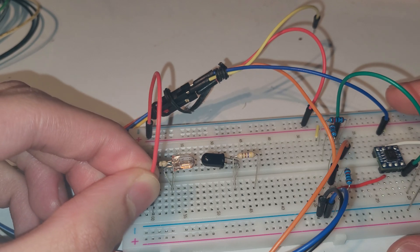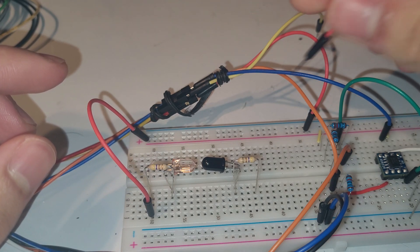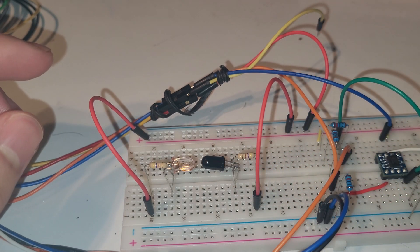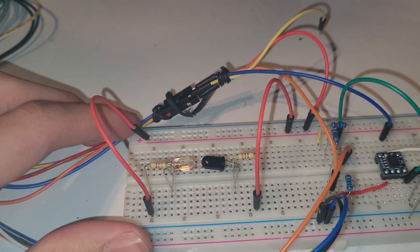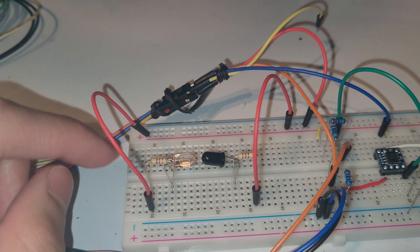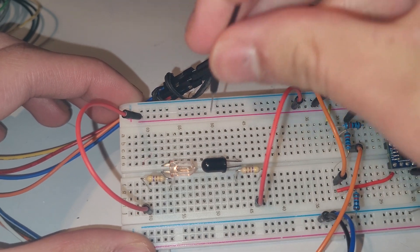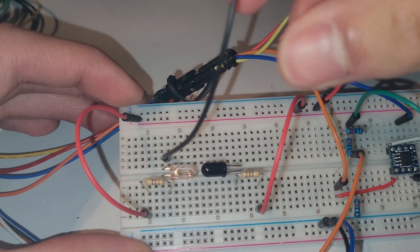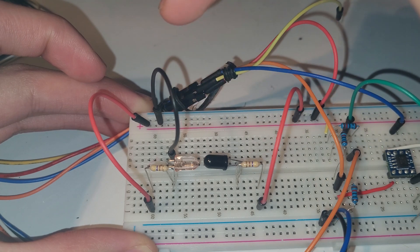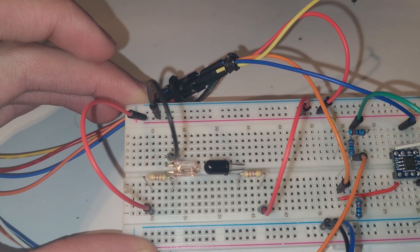Since this whole rail is power, I'm going to plug it in here and then in here, so it is in the power rail and in the same column as the LED. I'm going to do the same thing for the phototransistor — we want it powered on as well. Both are now in the same column as their respective resistors. We previously grounded the top parts, so the column with the infrared LED needs to go to ground, because current flows through the resistor and back into ground.